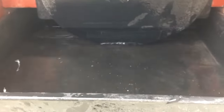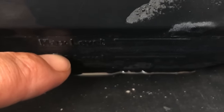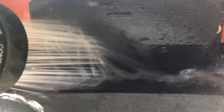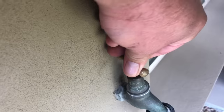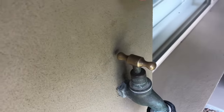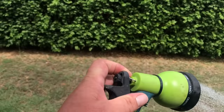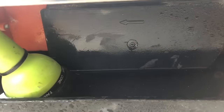The saw has a reservoir underneath, but I found that when I turn it on, it goes from max to min pretty quickly with all the water expelled from the blade. There are different ways to supply water to your saw — I'm turning my tap just a little bit, locking it into place, and setting it in the reservoir to provide water constantly.